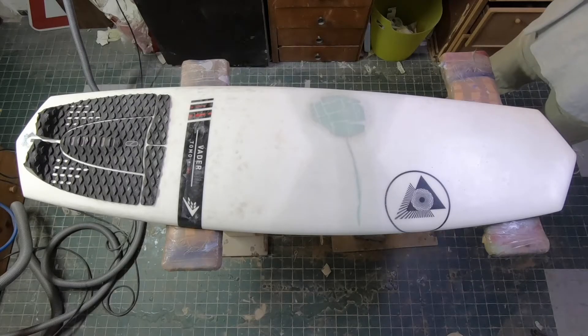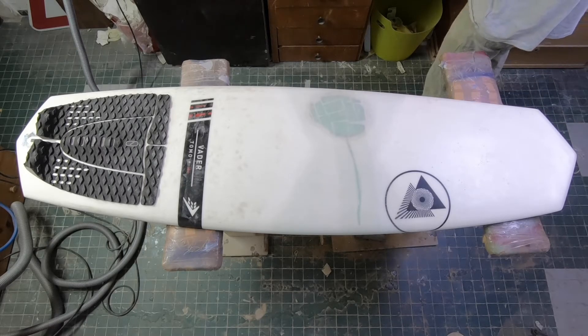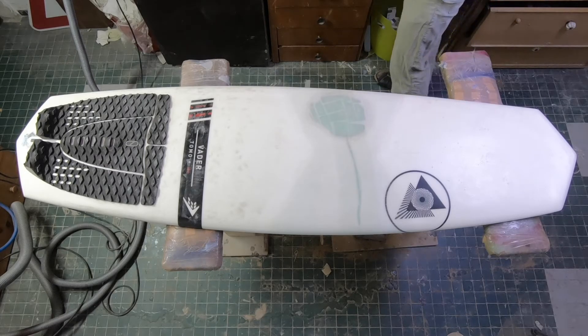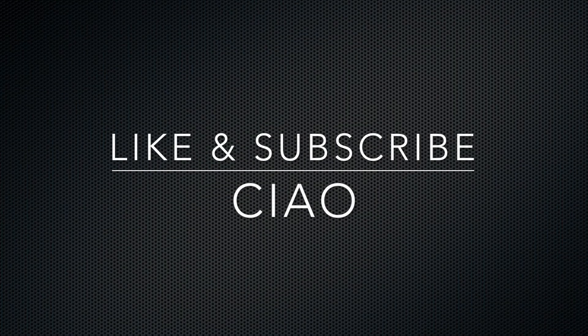Now the repair is finished. It might look a bit strange, but I purposely chose to use transparent resin because I like to see what is underneath. Paint can still be put on later. I used UV stabilizer to prevent the resin from yellowing. If you liked the video, like and subscribe, and see you in the next one.